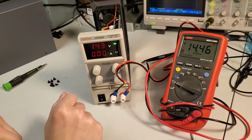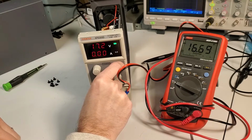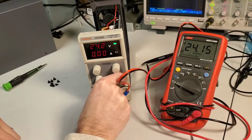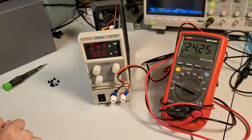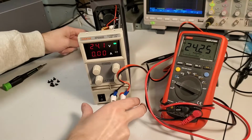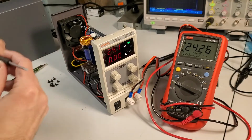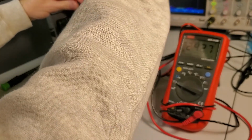Interesting. Okay, those are pretty close. Typically, if I'm running 24 volts, I have to have this set under. It is fairly cold in my basement today, though. I'm wondering if we have some temperature sensitivity. This is really just about on. So I'm going to see if we adjust this trim pot here carefully. I'm just going to pick one of the two to adjust.